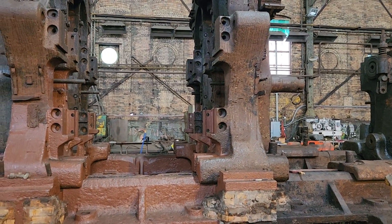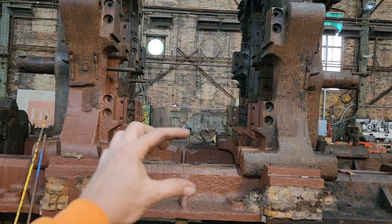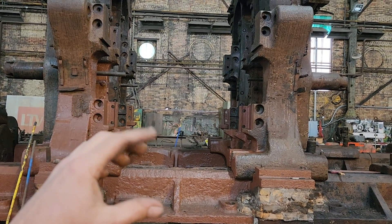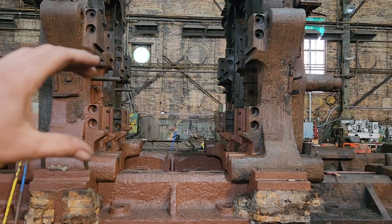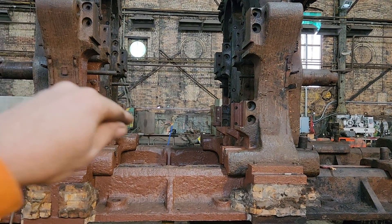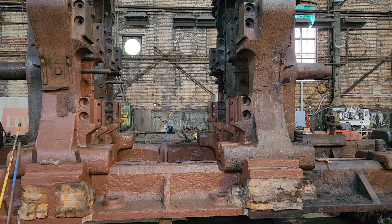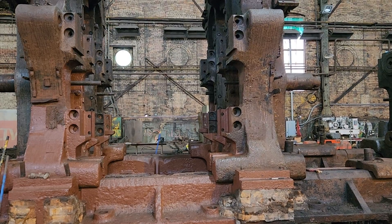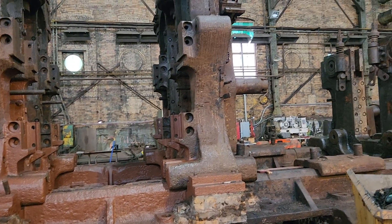What a rolling mill does is take in larger pieces of steel that have been heated up to around 2,400–2,500 degrees, then pass it between two big steel rolls, squeezing it down to another shape. So everything you see that's mostly made out of steel — sheet metal, plates, angles, I-beams, rails, anything like that — went through the rolling mill process.